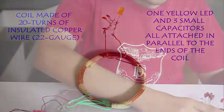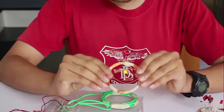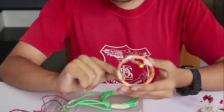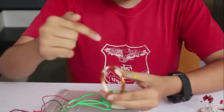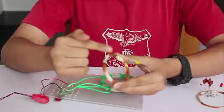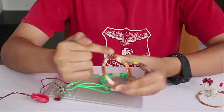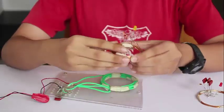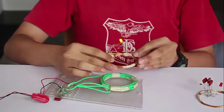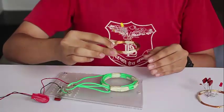This is the third secondary coil and you can see it has 20 turns of insulated copper wire and three small capacitances attached in parallel. One capacitor is 30NF and the other is 20NF each. There is also an LED attached. This increases the strength of the coil further, and you can lift this coil up and the electricity transmission will still take place.